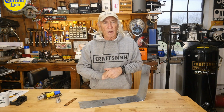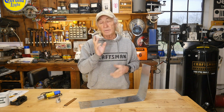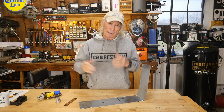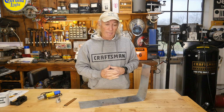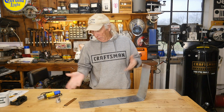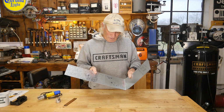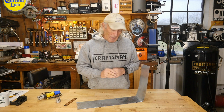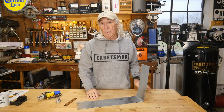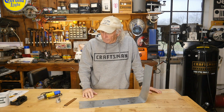Obviously, they still sell, I believe, spot welders. Harbor Freight sells spot welders for that matter, and I looked around. Beaver does not have a spot welder, or we'd probably have that one here today. They don't even offer one, and I don't think they'll offer one in the future. I don't see it as being a big market because MIG welding has kind of edged out a lot of the old spot welding conditions, but it's still an interesting choice for bonding two pieces of sheet metal together. And around the automotive world, like the old cars, there was so much metal in them that this was the way to go. It's an interesting thing, but we've got to move on.